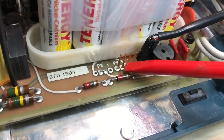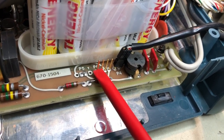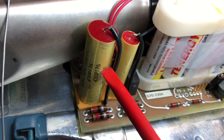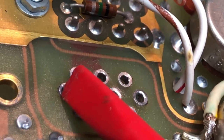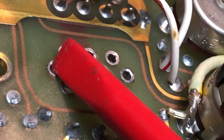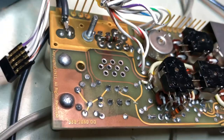Another quick point while I'm at it: this is the connector for the power switch P6 — you can trace this in the diagram. It comes from the input board right here. Be careful: this side is DC from the battery, these two contacts go to the power switch, and this is main line power. Since the line capacitor is sitting here, you're going to have line voltage in this PCB as well. I ended up removing the power switch because the connection was still intermittent — this through-hole trace is the problem. If I heat it up it starts getting connection, but once the solder cools down it's still open. That's a broken PCB trace.